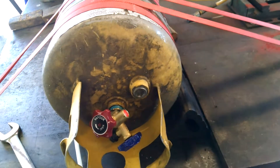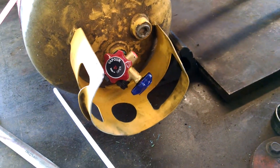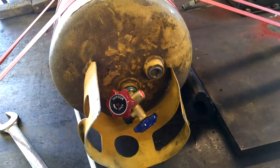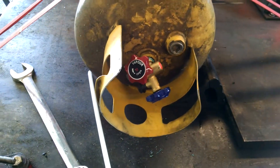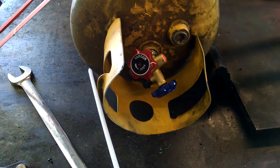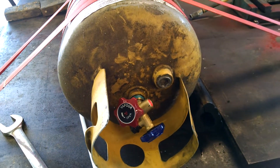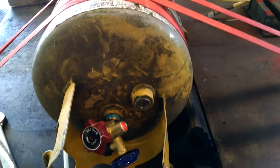If for some reason you try this on a propane tank, make absolutely sure you not only evacuate the tank. I'll start by saying if you're not a licensed professional on propane, don't even try it yourself. But if for some reason you do, use non-ferrous equipment to take the valves out — meaning you don't cause any sparks — needs to be non-friction, you need to be grounded, and you need to pump your propane tank with an inert gas after you pull it down to a vacuum, and so on and so forth.